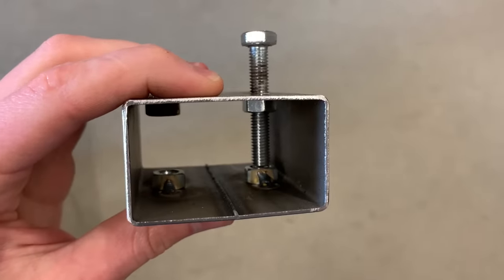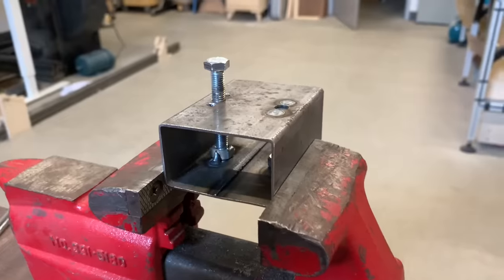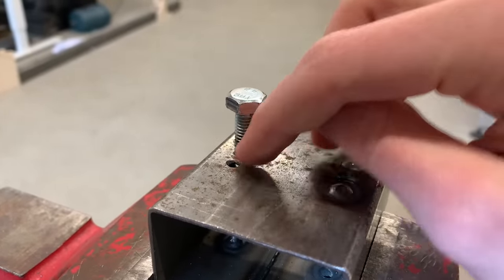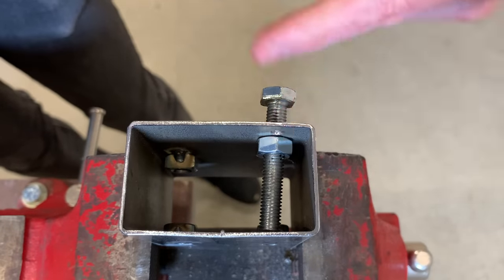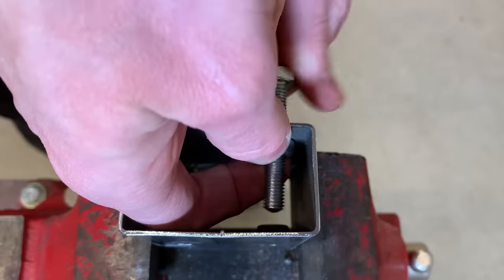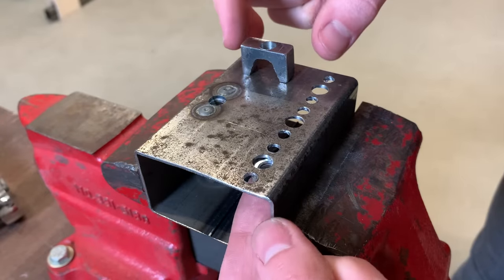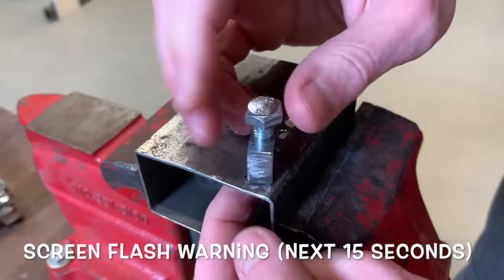You may have also noticed that I put this one straight across from a second nut already in there — to do that, I just put a bolt in that hole so I can push against it. The reason we're using a bolt to push off the opposite wall rather than tightening it down from here is that we can't have the bolt head on this surface, because I need as much access beside the bolt as I can for welding. It's also very easy for it to end up on an angle, which is why a longer piece of threaded rod is helpful — you can bring it back straight and put a square on it to check. Grinding a point on it also helps because when it hits the other wall it doesn't have as much tendency to walk sideways. Another option, if you're doing a lot of these, is to make a little pull-tool so you can pull it from the top and still have plenty of room to get in there with your welder.